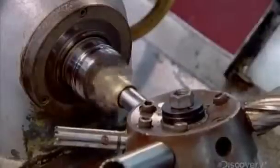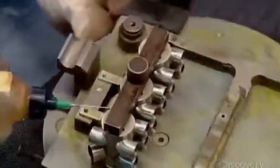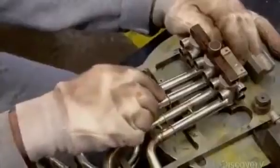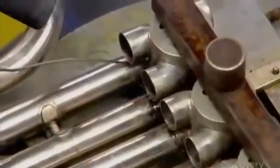After brazing the knuckles to the cases, they hollow out the case interiors with a cutter. Then they solder the valve cases to each other with connecting rings. They insert the tubing parts into the valve knuckles. These curved tubes are the horn's slides. The musician tunes the instrument by adjusting them in and out of the straight tubes.